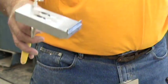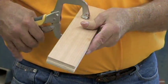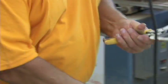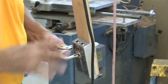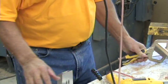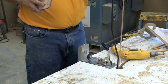What it very simply does, we take our face clamps to that magnet. Now, if we want to use this thing portably and drill pocket holes, we can come into here, boom, clamp it, and we can drill our holes portably anywhere we want. So that's why we call it the 3-in-1. It'll do 3 different operations. All right, let's take these rails back now, and I'll show you how we're going to put that curved raised panel together.